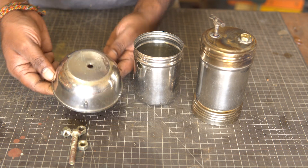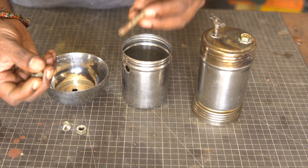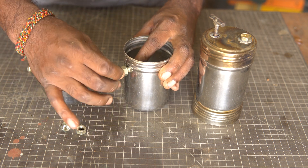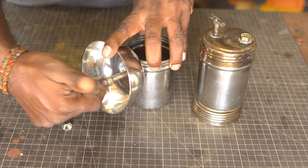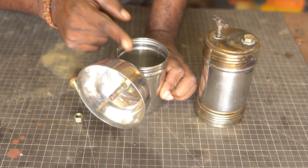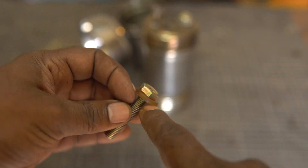Next I made a hole in the center of the reflector container and also in the body of the bottom container, making sure there is enough clearance for the reflector container to stay above the floor. These two pieces will be attached using bolts and nuts — the bolt goes in, we add a nut, then add the reflector, then add another nut and it gets secured. Now here is the important thing: we need to drill a hole in the center of the bolt so that the gas can pass through that hole and come out at the nozzle. I don't have the equipment so I took this bolt to a lathe and got the hole drilled there. The hole extends all the way to the other end of the bolt.